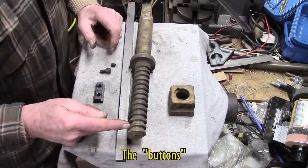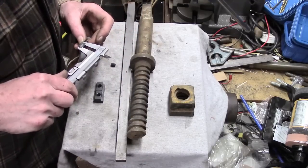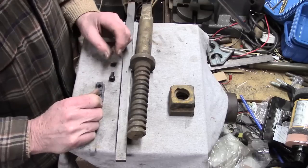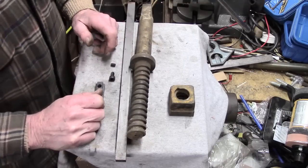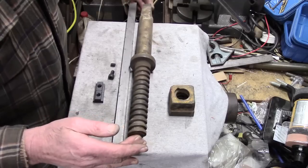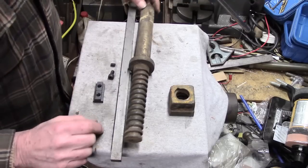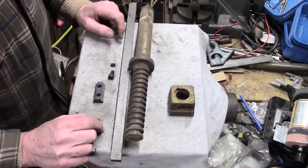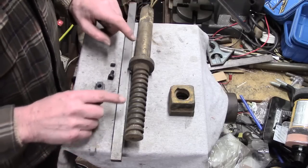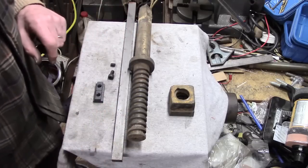Not quite sure of the thickness yet - they'll probably be about 400 thou deep. I've got a cap screw here that's 300, so maybe not as thin as I'd like. I may actually change the cap screws we're going to use. Anyway, this is just an intro - the stage of saying what have I got, which is the usual. There may be a significant pause here whilst the temperature goes down to minus 10, and it's just not worth even trying to heat out here then. So I'm going to get this turned down and we'll set up for some milling on the steel.